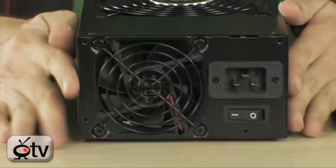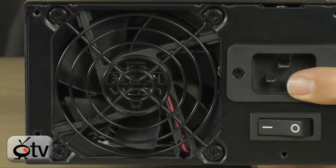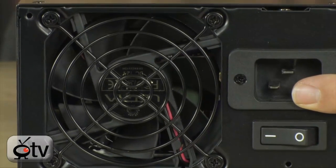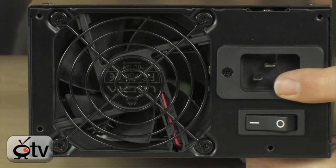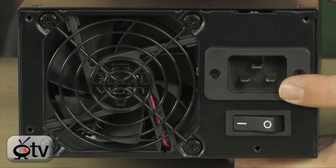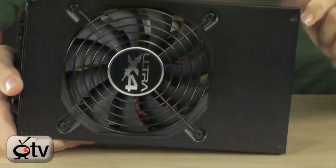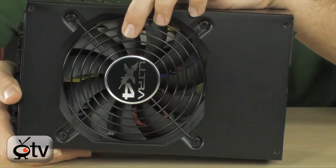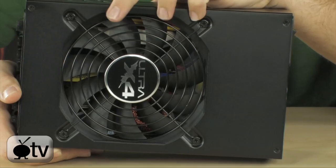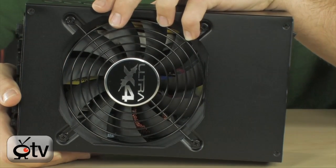On top of all of that, it does have an additional fan for cooling on the back — so it's got an exhaust fan and an intake fan. But ironically, it's really, really quiet. Until you get to about 1,000 watts of continuous usage is when the fan starts to kick up above around 1,500 RPM. Before that it's nearly silent — you cannot hear it. A 135 millimeter fan like this spins really slowly, usually under 1,000 RPMs, and will move a lot of volume of air without making a lot of noise. That's the whole purpose of having a bigger fan.